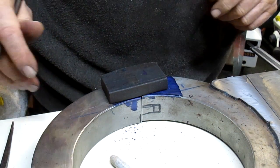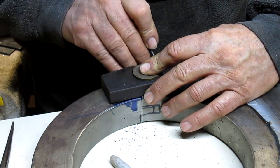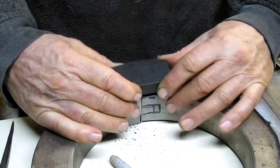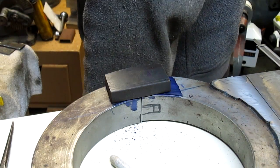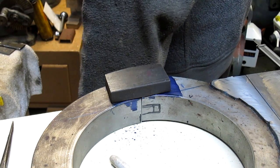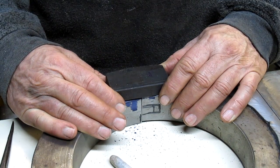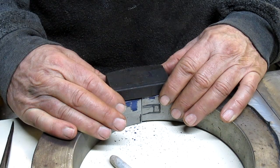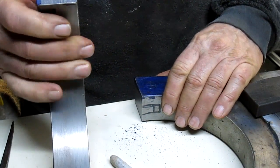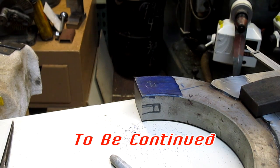So this also wants to have a circle. And a hole. So I'm seeing that we need to set up either a rotary table. I'm thinking maybe we set up the super spacer. Do we want to do that first, or do we want to cut our slots first? I'm thinking slots first. Let's do that. All right, we're going to take this over, drop it in the vise, and bring you over closer.